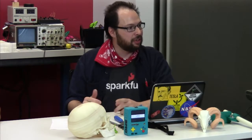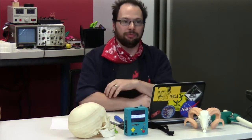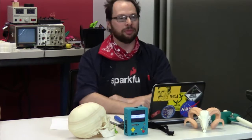and a lot of the lifting, curling, and separating is frequently due to temperature control problems. So it's wise to keep your printer installed in a very temperature controlled environment where there aren't a lot of drafts. And sometimes that's not necessarily an option. So it might be advisable to make an enclosure for it.